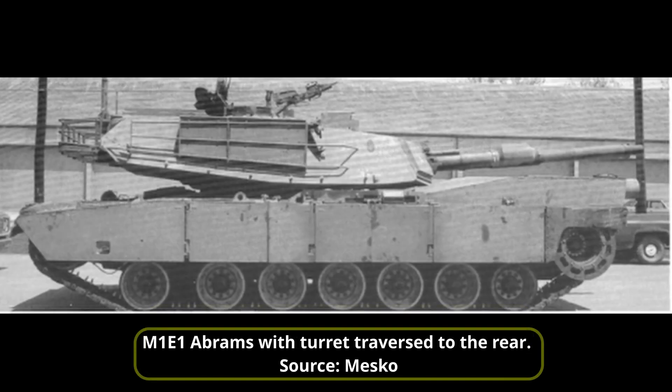One consideration for upgrading mobility was to reduce weight. Simultaneously with increasing the size and weight of the main gun and adding more armour to the turret, there was an attempt to reduce the weight of the primary construction elements. In 1985 the idea was to take the single largest and heaviest element — the hull — and make it lighter. The all-steel welded hull offered few options, so the project switched to the concept of making a completely new hull out of composite materials, but those plans formed no part of the M1E1 or M1A1 as approved. Improved final drives and transmission were fitted to increase reliability and deal with the additional load.